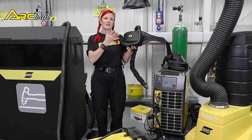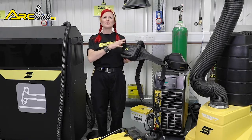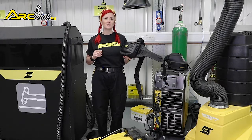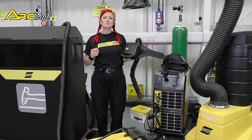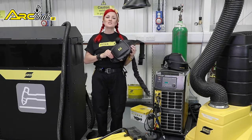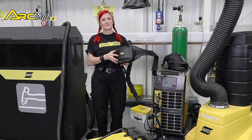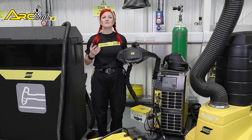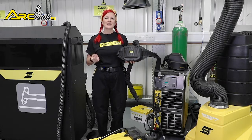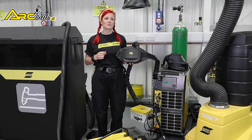If you're concerned about the lack of airflow when using your PAPR, relax. PAPRs will sound visual and audible alarms if the airflow falls below the minimum safe level. If the battery is charged, this probably means you have a clogged filter. Under normal use, filters need to be changed every one to two weeks. Some PAPRs come with a convenient airflow indicator. As best practice, I test the airflow rate before each use and check the pre-filter and main filter after use.